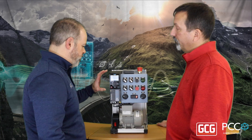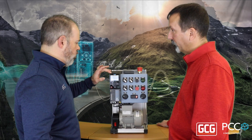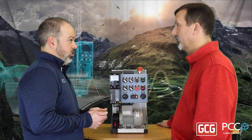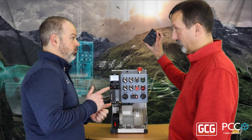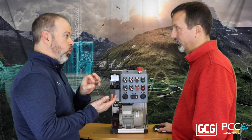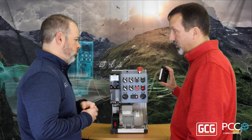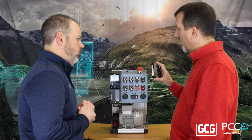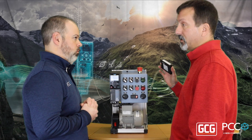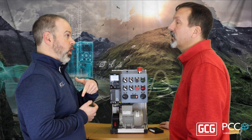From a configuration perspective, I see we've got the IOP here. On the G120, something that's nice is you've got that smart access module where you can access it from a mobile device. Same — that works on this as well. So we can take that mobile device, bring it up in a web browser, and configure or troubleshoot it that way. It's a wireless access point and you don't run an application — you just access the webpage inside the drive. So it's actually serving up the pages wirelessly. Correct.